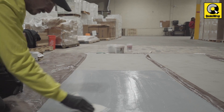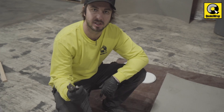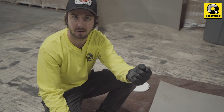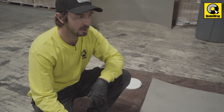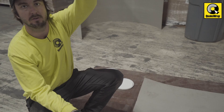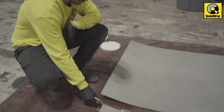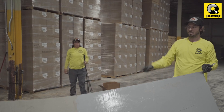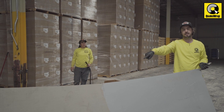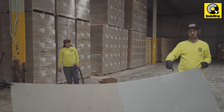Try to minimize the amount of resin you get on your plastic protective tarps or anything like that, just to give us a little bit more access and ease of handling. Depending on the application it might make sense to have one on each corner depending on the elevation you're trying to work on, but on this one, one on each top corner should be perfect. You want the non-resin end to be the inside of the jacket — the resin side is going to be the outside layer of the wrap.